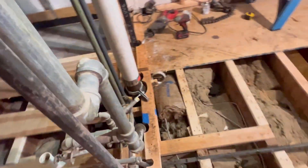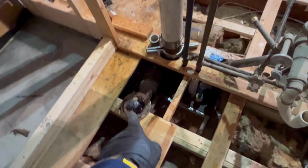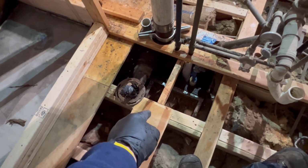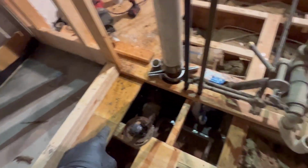And right now we're going to work on the waste for the floating vanity here. I'm going to move the toilet bowl over. First I'm going to lay out where my water closet's going. I'm moving it over maybe 3 inches, and then I'm going to work on the vanity, but that's where the shower stall is. And after that, we're going to do our water lines. This existing is coming from the other Navien. This is the domestic hot feeding the third floor.